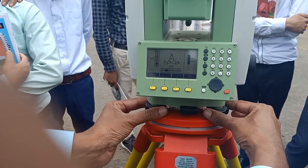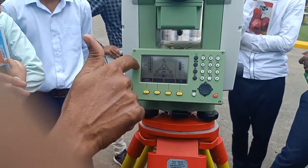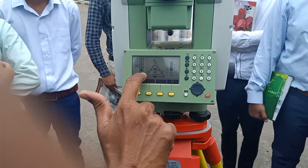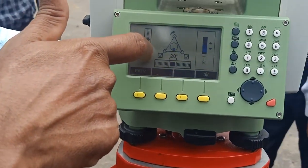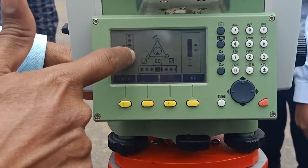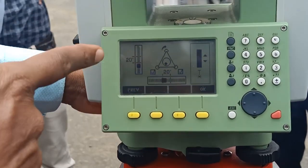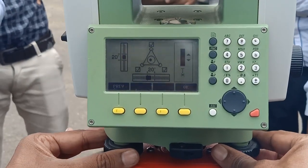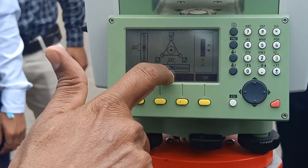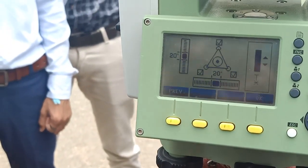You can see in the video. Operate both screws in or out simultaneously. The horizontal bar bubble is now at center. Now for the vertical bar, operate the one remaining screw to bring the vertical bar bubble to center. There may be a slight change in the horizontal — correct it again. Now horizontal bar bubble is at center and vertical bar bubble is at center. When both are centered, the triangular small circle in the middle will also be at center. Minor leveling is done.